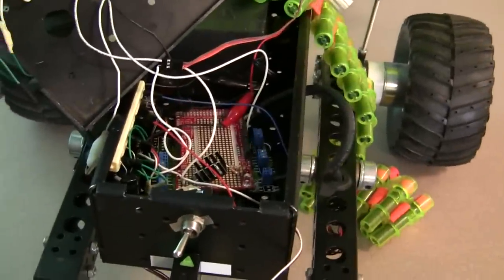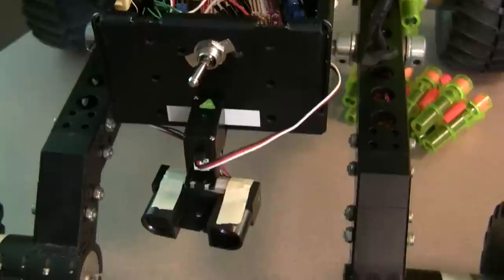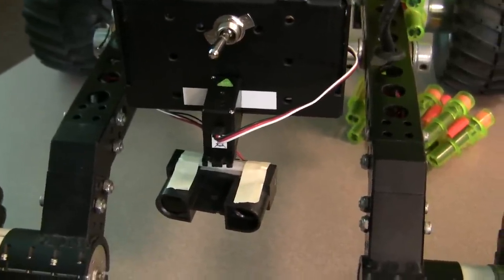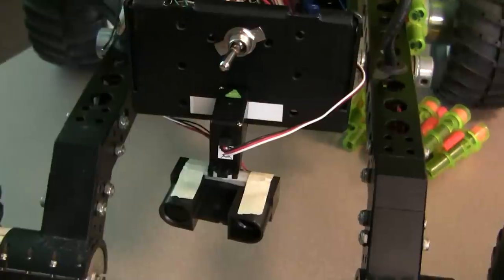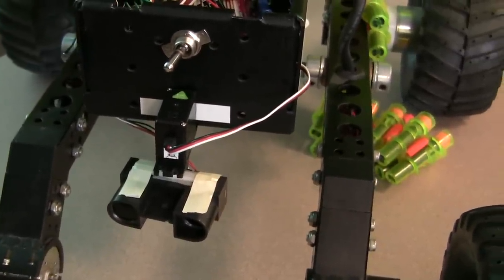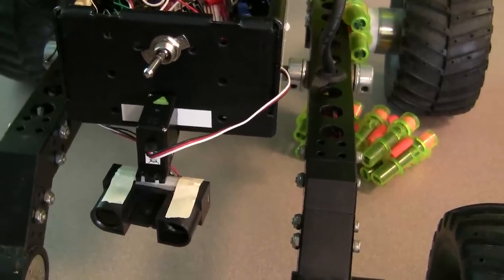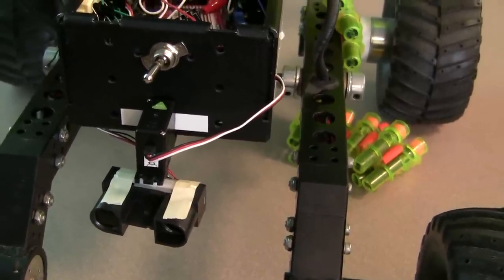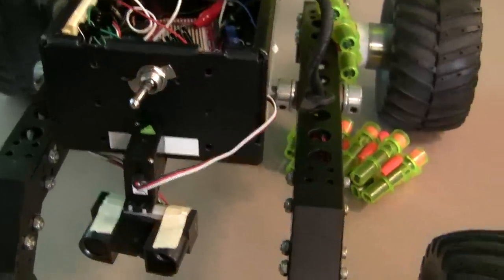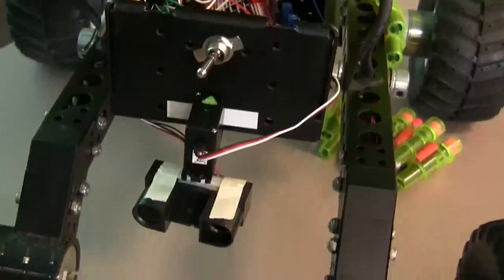In this Arduino board and the controller, it is attached to an infrared sensor, which detects people or actually detects anything in front of it. It's not any particular distance, any change. It first scans to see what's in front, and then if there's something different there, it shoots. In other words, it's looking for anything that changes at a specific distance. It's always searching, and if it finds something, it hones in on it, then turns the entire turret, and then fires.